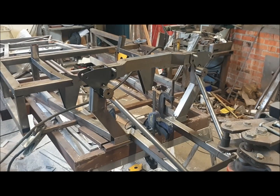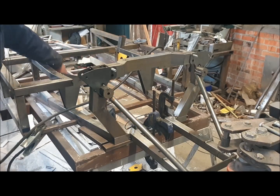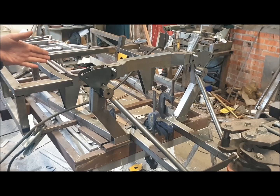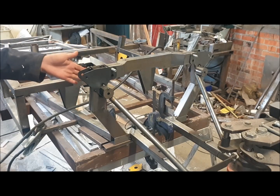The last part of finishing the engine bay is to put the back of the chassis on that we made earlier. I've just thrown it on and clamped it down. I've spent some time making measurements from the rear bulkhead to this face to make sure it's vertical, and making sure it's parallel by measuring off the front face to the back of the seat-based bulkhead. That guarantees we've got it straight. If it's not perfectly straight, we know what to correct when we put the two triangulation bars in.